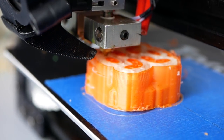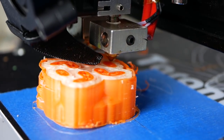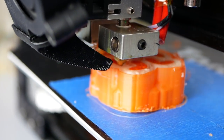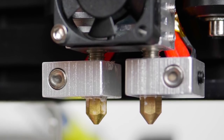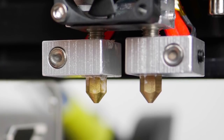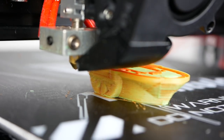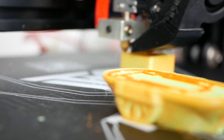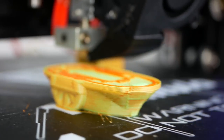So everything I told you so far is totally similar to the $250 single extruder Tevo Tarantula. Then what are you getting for the additional $100 that the dual extruder model costs more? As the name suggests, this model has an E3D Chimera style hot end where 2 separate nozzles are mounted next to each other. An additional Bowden tube and feeder motor allows you to create 3D prints with either 2 colors or even 2 separate materials like soluble PVA support or even crazy combinations like nylon and PLA.